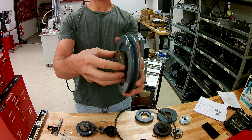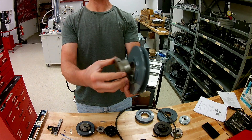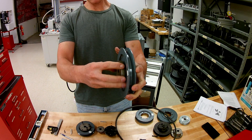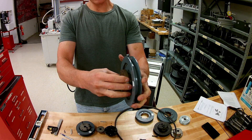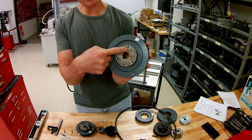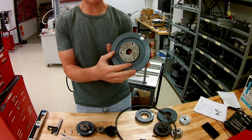They should kind of fit or nest together like this. Now if you grab it and it looks close but it's not fitting, don't force it — obviously it's not the right fit, so we're going to spin it around. As these things come together and become tight, the clearance is taken up and it'll actually start to close that gap, and what it does is it uses that bore to squeeze around the shaft.